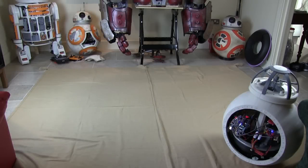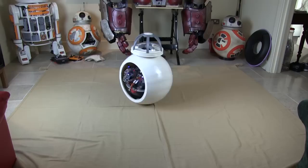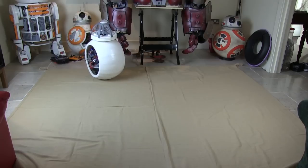I'm going to give that a test with the mass lower. It was a bit harder to tune up because the reaction force of the mass is better when it's higher up — it pushes the ball side-to-side more easily. At the bottom, that part of the ball's stuck on the ground. I do seem to have it fairly stable though, and it's feeling not as top-heavy, so I think this might be where I actually leave it — a good compromise between putting lots more mass in the ball. If I just drive forward here, it seems to work pretty well. You can see the front-to-back wobble still there, but side-to-side, we've pretty much killed it.